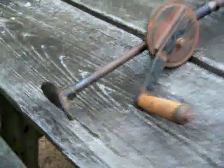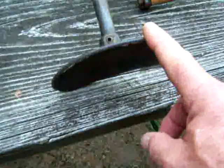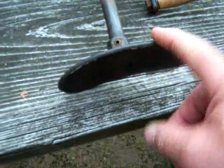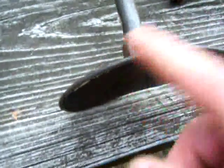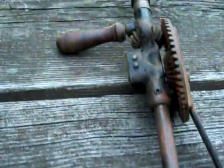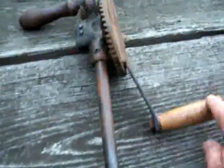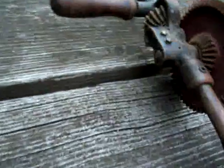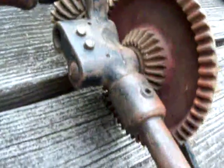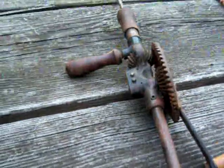And this one here is called the belly drill — it's not quite as common as the others. This is two-handed and into your belly. This beveled piece here actually has a set screw on it; you can turn it either way depending on how you're standing and how you're using it. This curved piece pushes up against your belly. One hand on the handle over here, one hand on the handle over there, and you crank it. That's a big worm gear there — these worm gears have very little play in them really, from the amount of pressure they put.